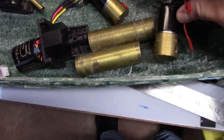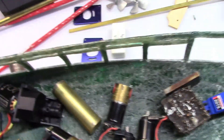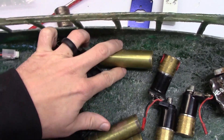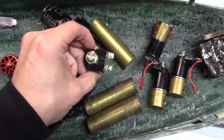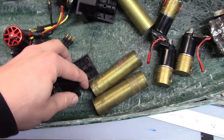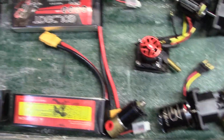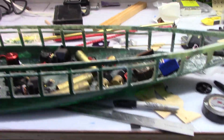In this case, what I'm going to do is stack them — I'll stack the solenoids and accumulation tanks above each other. There's plenty of vertical room there. This will go on top of water channeling, so that's something to consider. Basically having one on one side and two on the other, and the whole module for the side mount in the raised turret will most likely be attached to the deck. I can plan for the motors further forward — the advantage of getting the motors further forward is that it generally allows for a shallower shaft angle.